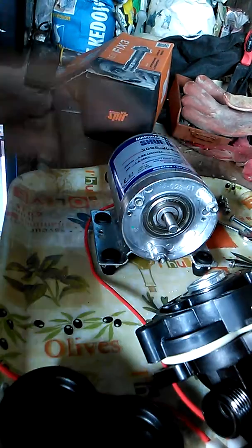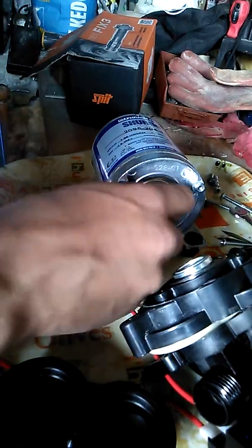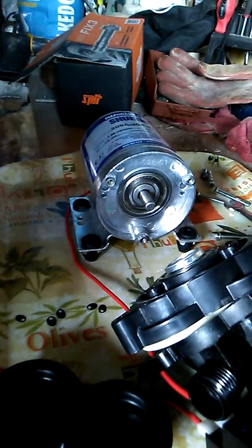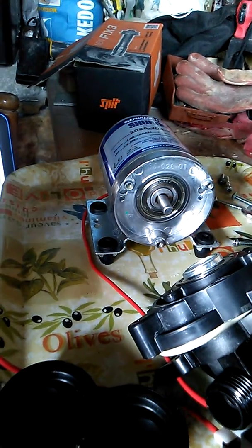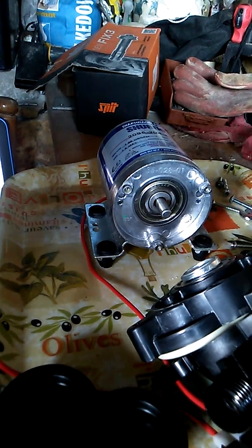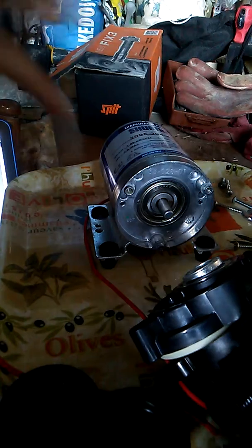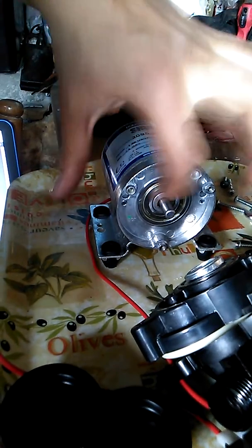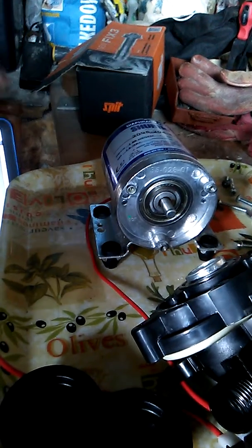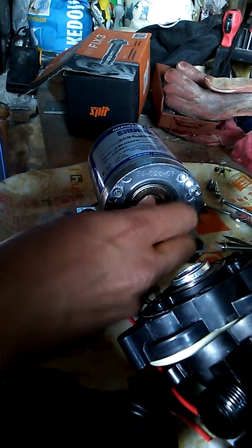But as we know, the motor isn't turning at all. And when we tried moving the crankshaft ourselves, it didn't move. So maybe it was rusty. Maybe there was something causing it to not move. So if that's the position you're at, then maybe a good idea would be to have some high viscosity grease and put a dab of it inside here, and check that the connection here isn't stiff, isn't rusty, because it might be. That was our problem.